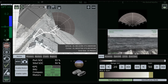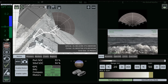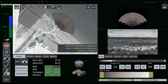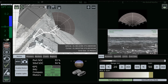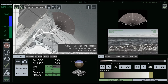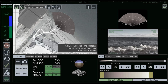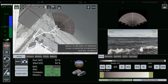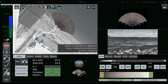What we do for beach profiling is we take a fixed length mast and we use the RTK X, Y, and Z data. And then because it's a fixed length mast, we know that if it's a 2-meter mast, whatever the RTK Z measurement is, the bottom is 2 meters below that. So it can give you a very, very precise measurement with the RTK, or the depth sensor is, I think, plus or minus 30 to 50 millimeters.